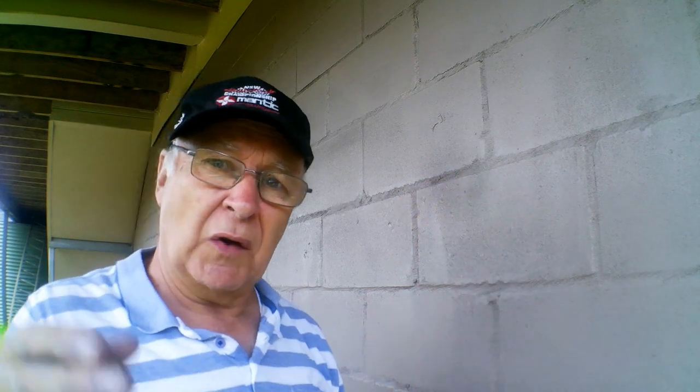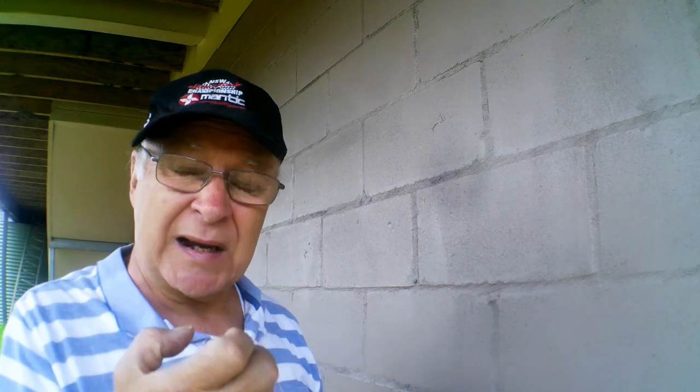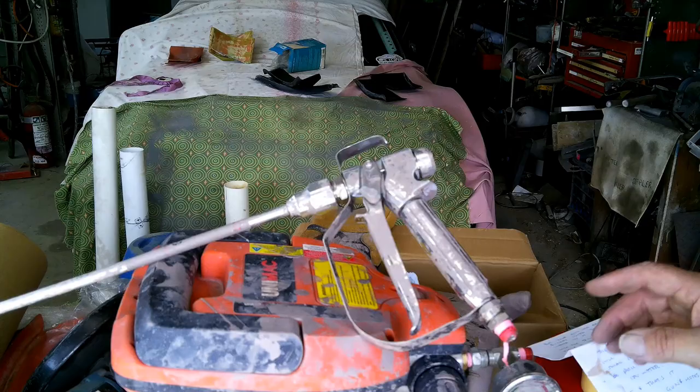And then turn your pump on and just leave that gun to suck the clean water up and spit it out underwater into the waste bucket, and leave it go for about 8 to 10 minutes so that you've got about that much water gone through the gun. And then take your gun out and do a test spray somewhere and see if it's just water. And if it is, your gun's thoroughly clean.